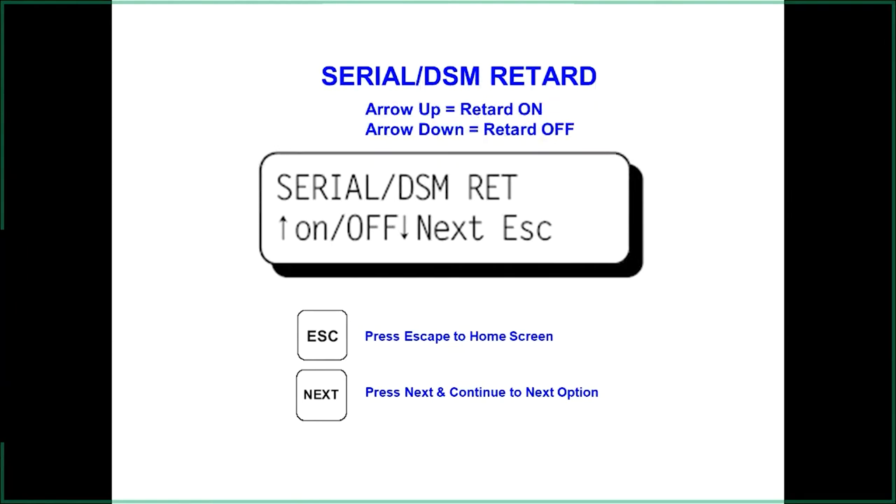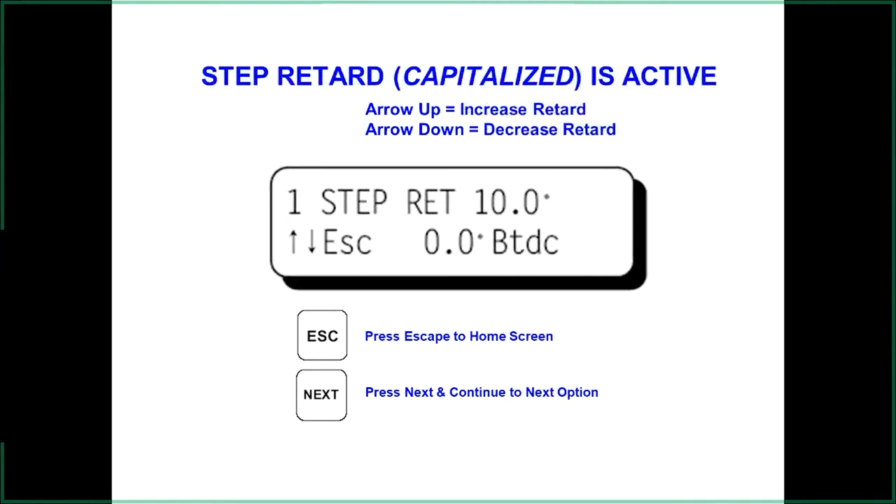The one-step timing switch can be turned off and on from the keypad. It allows external control through a PLC or panel — you can see here where it's turned off and where it's turned on. Different things can trigger it: high air manifold temperature causing potential detonation could ground out the one-step timing control to retard timing, keeping the engine out of detonation, or an annunciator or PLC monitoring exhaust or air manifold temperature can toggle the switch automatically.